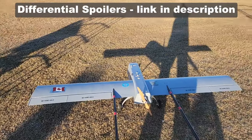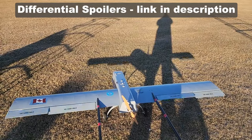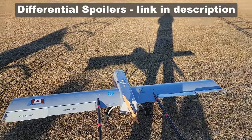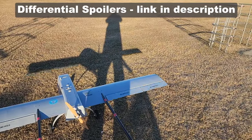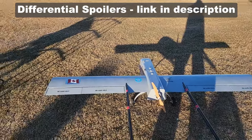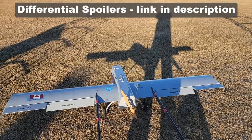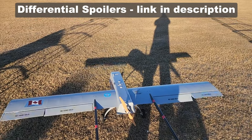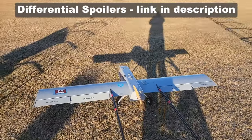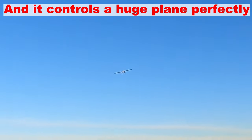That means if I turn to the right, both surfaces move. So it actually uses both control surfaces for our aileron. And you notice that the outside, or the aileron surface, moves more than the inside surface, which is the flap surface. And then of course it also acts as flaps. So flaps down, and flaps down. Crow flaps. Now if the flaps are down, the control surfaces still move. And that's all differential spoilers in ArduPilot. And there she goes. Oh my God, it works.